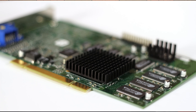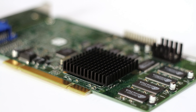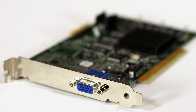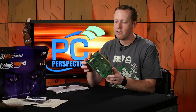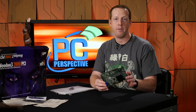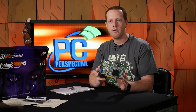This was passively cooled by this tiny heat sink here, and you got one SVGA video output. I did a little pre-research trying to figure out exactly how this GPU stacks up in today's modern world. This is a PCI graphics card with a 143 megahertz clock speed, a 300 megahertz RAM DAC, which was actually much more important back in those days. This could do 6 million triangles per second.